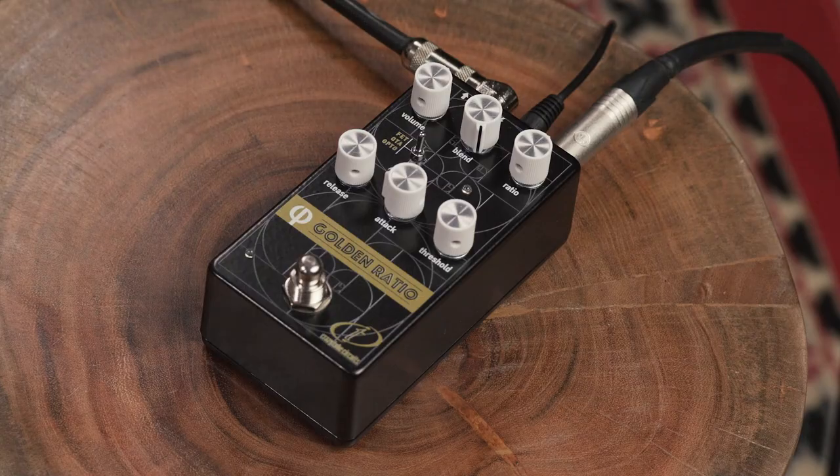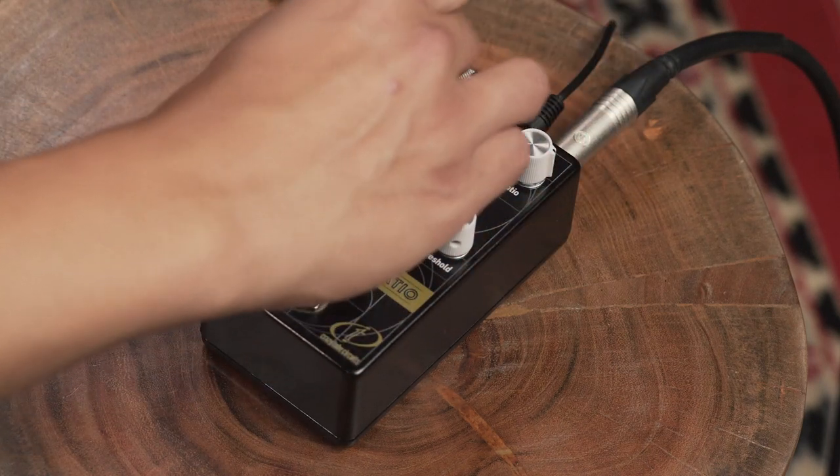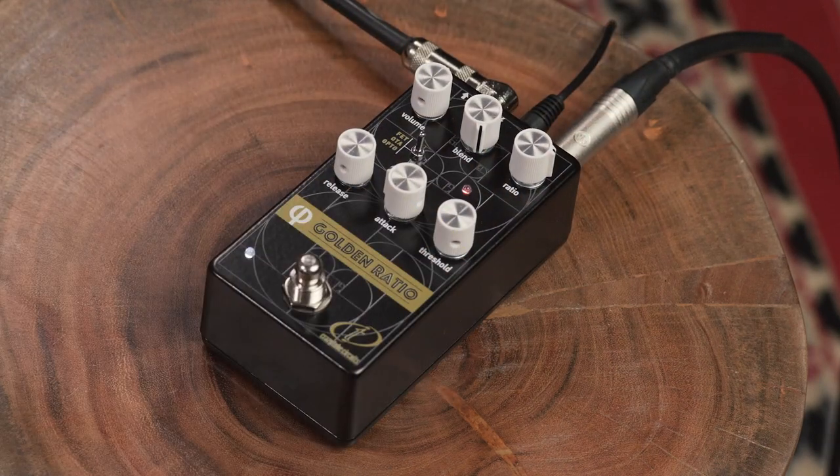Well, if you've ever played a compressor with two knobs on it before, chances are it was based on an OTA compressor. Ross, the MXR Dynacomp, you're looking at Keeley compressor, Wampler compressor, they're all based on that wonderful sound, that squish, that classic compressor. A little bit rounded off in the top end and a nice squish in the attack. Let's hear what we got going on here. I like to set the ratio really high, get the attack pretty quick, and I'm gonna bring up the release a touch.